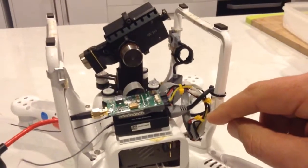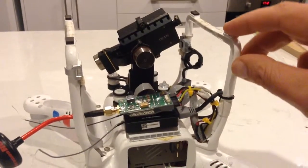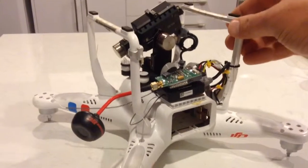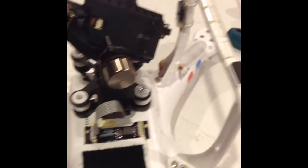So essentially I'm going to remove all of this and have a clean platform and redo it all to get it looking good and functioning really well. Here are the power cable and video cable for the immersion transmitter. It's unlikely that those plugs are going to fit through that hole, so I'll probably have to disconnect and desolder those, then re-solder them back again.